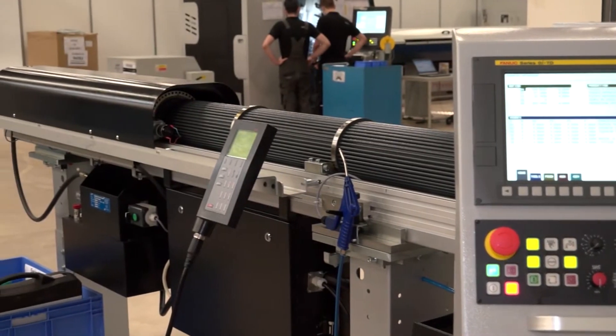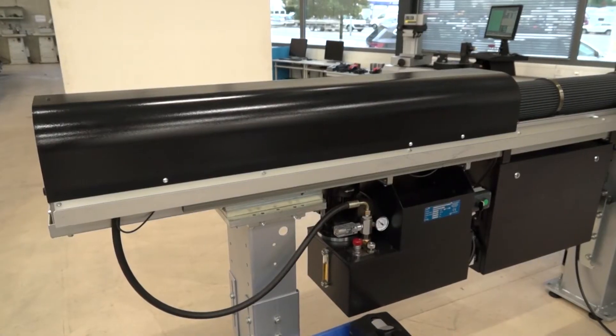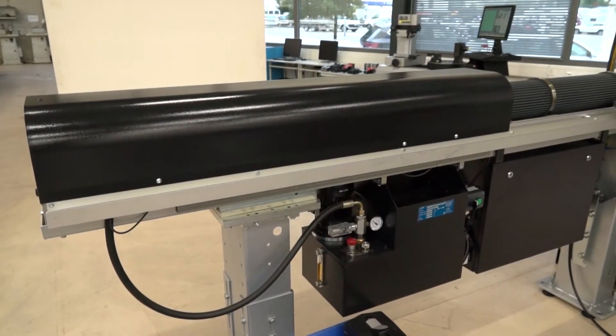What about the feeding of the bar — is this a completely integrated machine, or do you add a bar feed separately? With bars rotating up to 16,000 RPM, you need a very good and precise feeding system. Therefore, we work with a Swiss supplier to make a perfect adaptation in both the design and the machining process of an automatic bar feeder.